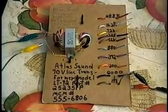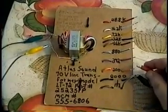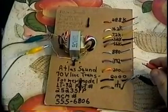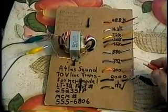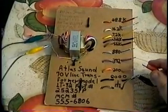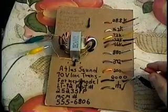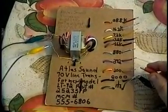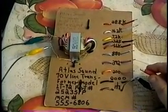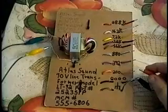The noise we hear right now is because the receiver is not connected at all. The first thing we'll do is connect it to the orange wire, which is the 200-ohm tap, using the black wire as the common. The black wire has a clear piece of wire soldered to the transformer frame, and a ground wire goes from the transformer frame to one of the input leads. It's the secondary as used in a PA system, but here it's used as a loop transformer in step-up configuration, so what they call secondary is now primary. There's a resistor and capacitor network across what we're using as primary — a grounded side and a 120-ohm resistor in parallel with a 0.001 capacitor. This arrangement reduces the tendency to pick up electrostatically induced noise and avoids oscillation due to electrostatic coupling.